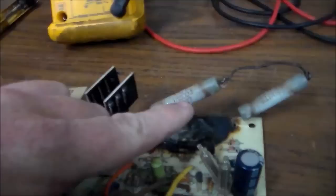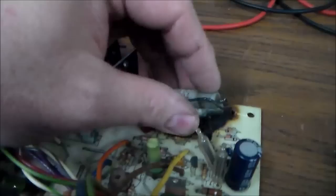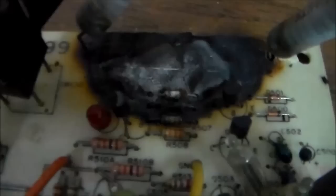Yeah. My meter is off like 2.2 ohms usually, so anyway. I think that 1R500 is telling you that it's 1.5 ohms, that's my guess. Okay, so what they did was to create something like a 3.8 ohm, they tied these two together like that and put that in there. And then at some point they fell down or something, and it sent the power that runs through that into other components here and cooked everything. Look at that crap. They're killing me here with this stuff, right?